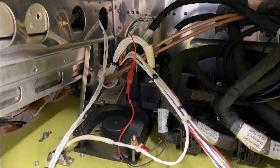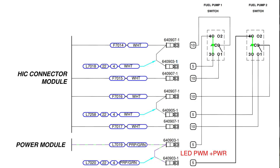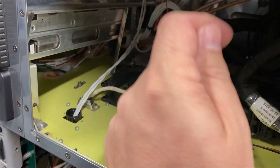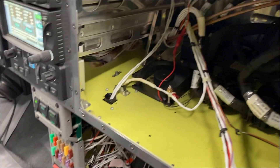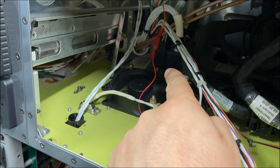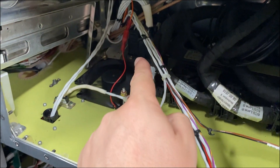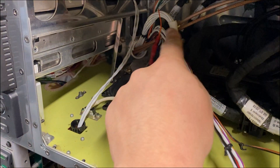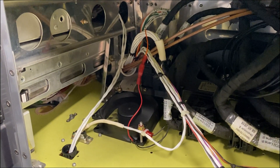There's some issue. When that light is engaged but it's not running, that means the ground wire is connected from here all the way down, which makes that light illuminate, but the positive pin is not connected. Sometimes if you jiggle it differently, you can get the light to go out and the pump to go out at the same time. I'm not sure if the problem is the connector or the PCB board. I think I'll just order a new PCB board — that's the quickest thing to replace, held in place by four screws. Maybe Vans should separate this connector into two different connectors for redundancy, to extend the redundancy Rotax had built into their design.